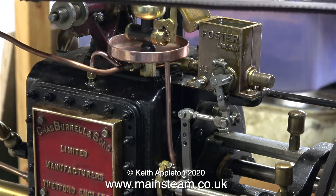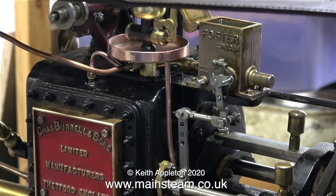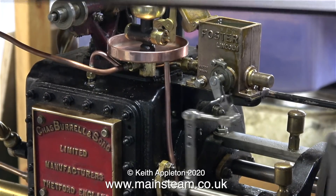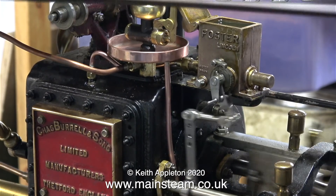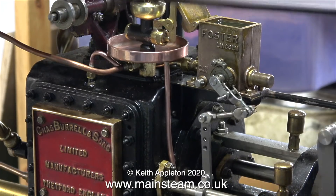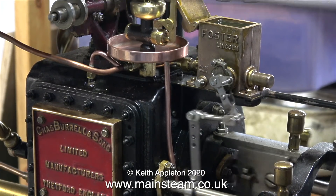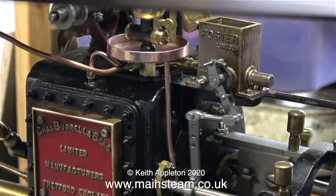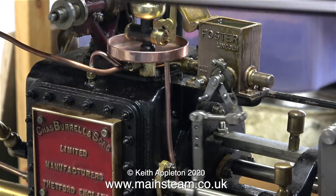Is it going to work? Well I hope so. If it doesn't work fully, at least it will catch some of the water. Here I am once again running the engine using my very, very small compressor, and you can clearly see at this speed how fast the arm on the lubricator is rotating. When I tightened the union nut onto the end of the adjustable part it didn't appear to move, so this should be okay. I'll keep my eye on the oil level and as long as it goes down, everything's fine.